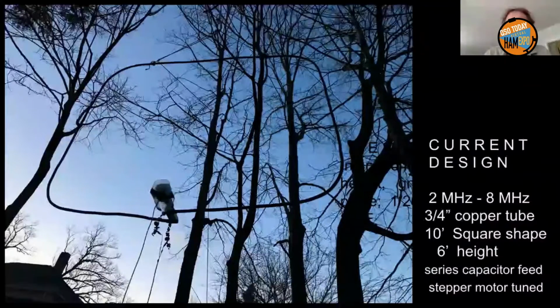The width of the antenna is crucial. And if you have, say, a 1.5 to 1 rectangle where the narrow side is horizontal, you can get almost twice the area compared with a circle of the same width. And of course, area is what you want.